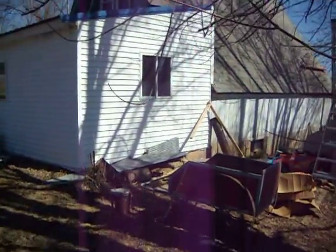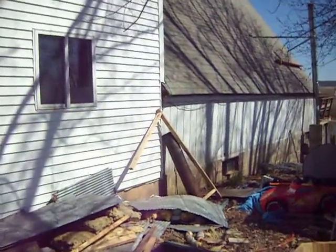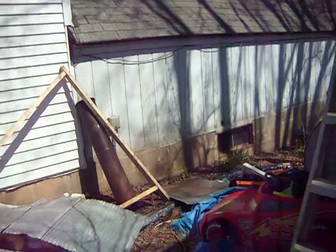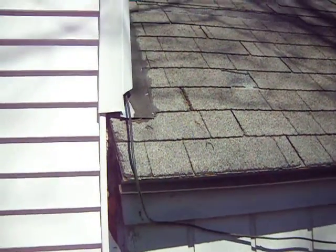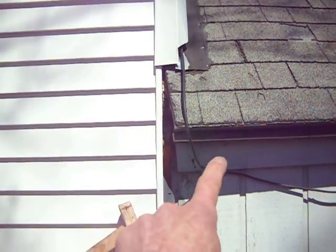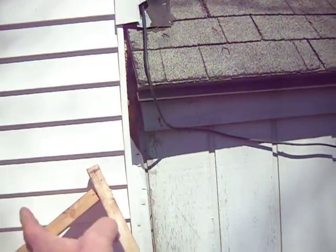And when I looked at it, I knew I had to do some work on it, but I didn't know how much. I knew I had to put a roof on it, but alright, they put this addition on, and remember the guy up there that owned the trailer helped them put this on here? Well, it's not the right way. There's water leaks in it like you wouldn't believe, and it's running down the walls and in between where the house and this addition are, it's running down behind this wall, and it's rotting off both walls.